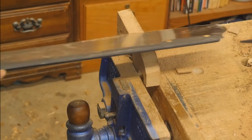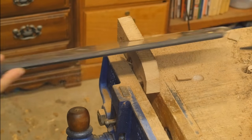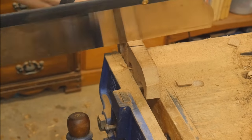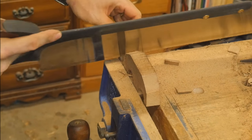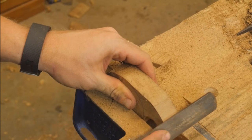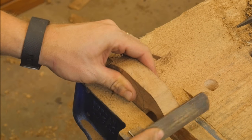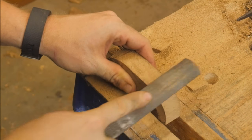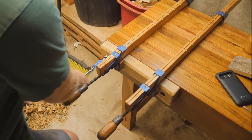Now that I have all of the holes cut I can come back in with a combination of saws to sculpt the shape. I get most of the material very close with this and then come in with a turning saw to make all the round curves. Now that it's basically shaped I can start using rasps and files. I'll start with a very coarse rasp and refine the shape, then go finer and finer until I'm using such a fine rasp that it's actually giving it a smooth surface.